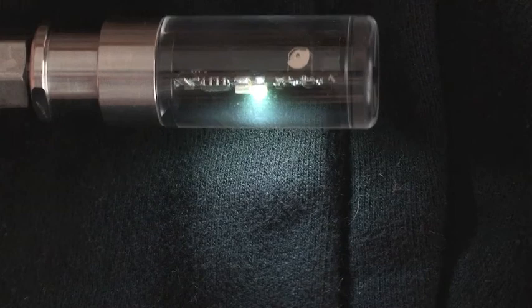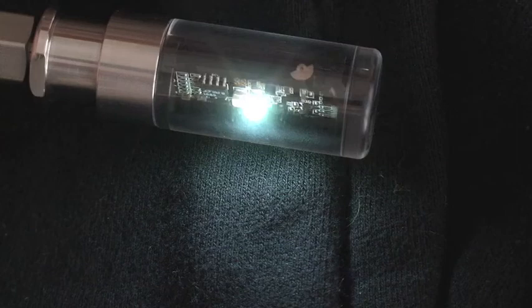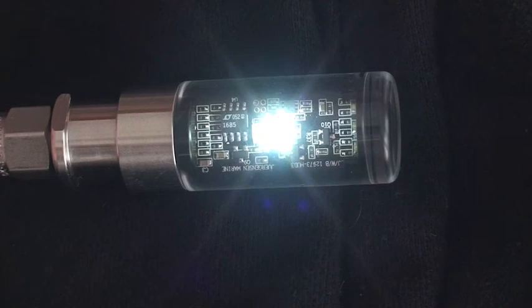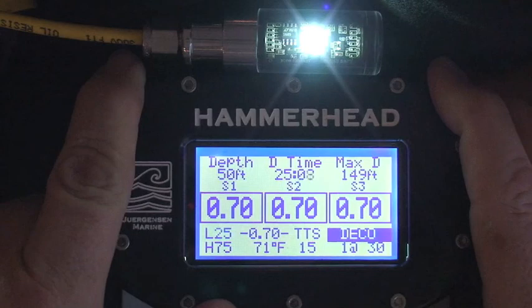This puts a bright white headlight facing away from the diver's mask, which points in whatever direction they happen to be looking. While this does not replace a proper dive light, it is useful for finding lines in caves, reading a slate in the dark, or assisting a diver to find their way in the event their primary dive light failed. The duration the Diva headlight will remain on is user-definable in the Diva configuration menu.